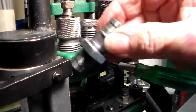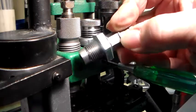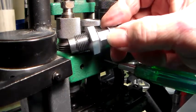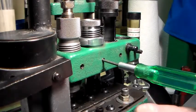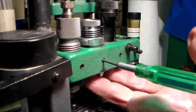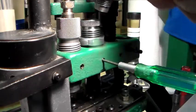Here's the adapter that I made, which has a locking ring — a locking nut — on it. I also cut flats on it so you can use a half-inch wrench to hold it to lock it in. The main difference in the RCBS powder-through and the Lee is that the Lee — the part that actually does the case mouth flare — is floating. So it runs up and down until it hits the bottom of their stop.